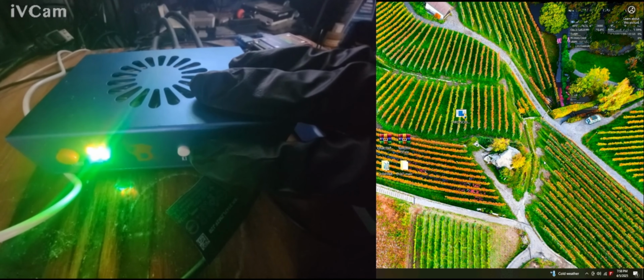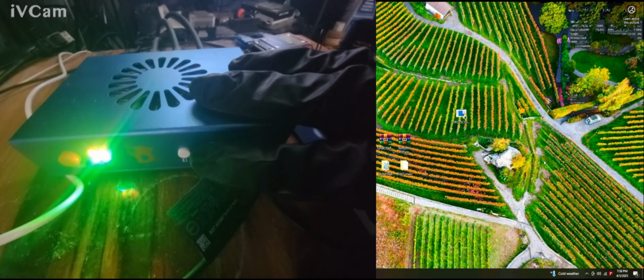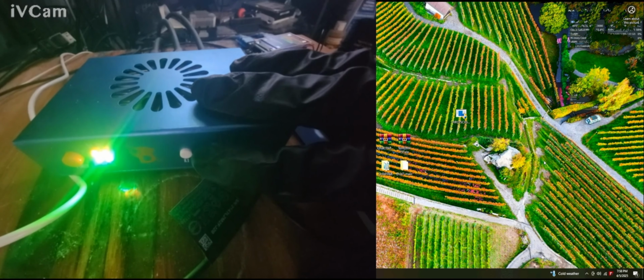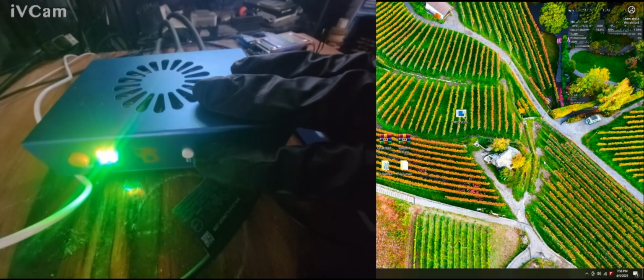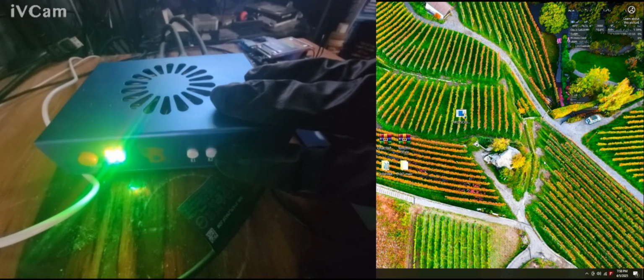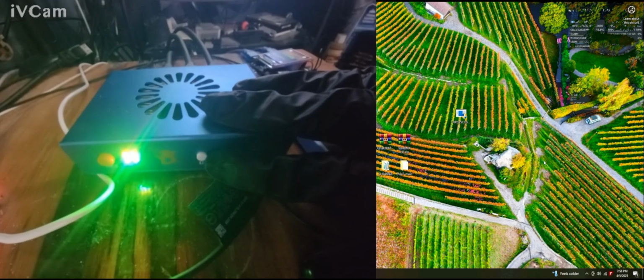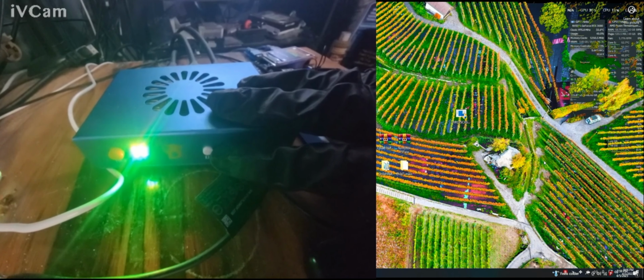The next 4 buttons, K1 being to change one of the preloaded EDID files, which you will not want to ever press as you will be changing the EDID to a different resolution than your monitor probably supports. If you do accidentally press K1, it has 5 modes, so you will just want to press it 5 times, giving it time to reboot and load between each press. On some versions of the fuser, you have to hold it, and a press will do nothing.